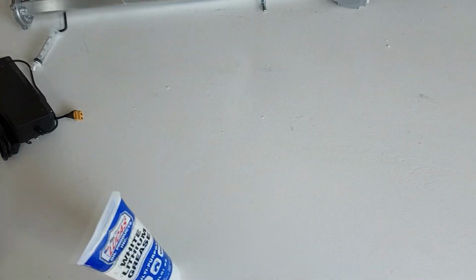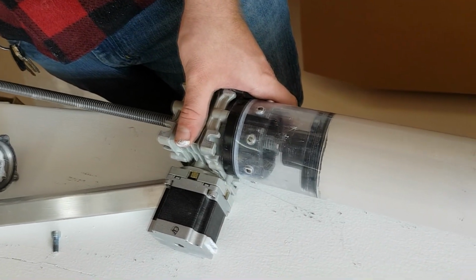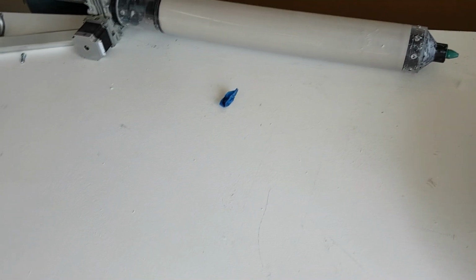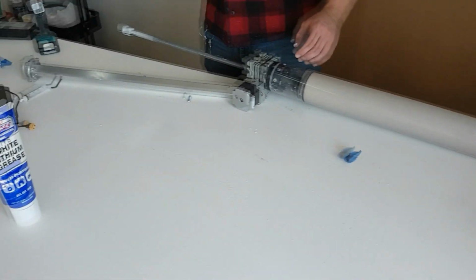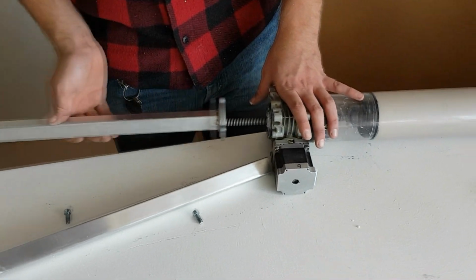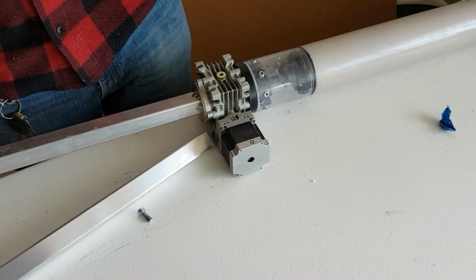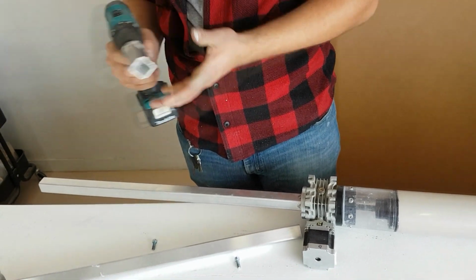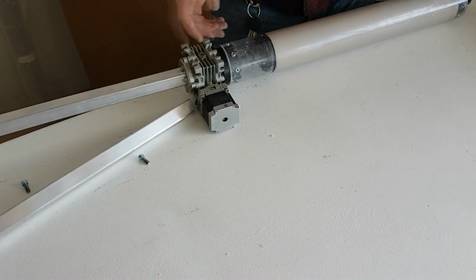You can then reassemble your extruder with your full tube of clay. You can push the Acme screw down with the anti-rotator tool to slightly prime the clay piston. It does not prime it fully, and we should let the motor handle that with a prime program. You can then slide on the anti-rotator, which stops the Acme screw from spinning in place. This is very important to install, as if you start a print without the anti-rotator bar on, the Acme screw will just spin endlessly, not moving.